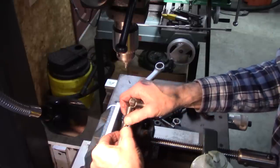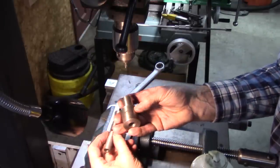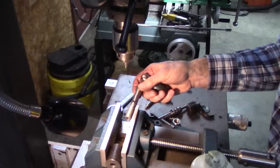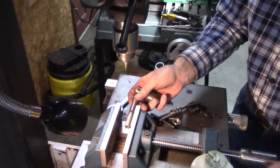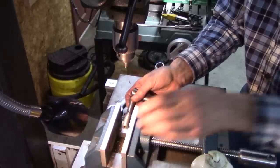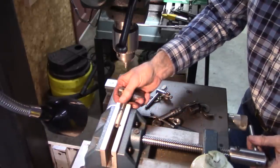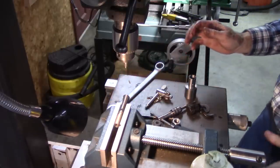That's the one I'm going to have to enlarge quite a bit, because this has got a slide inside this with that set screw aligned. I'm guessing I'll probably make it at least a quarter inch, maybe a little more. Of course, the hole going through it this way is only a quarter inch, so I can't go too far.